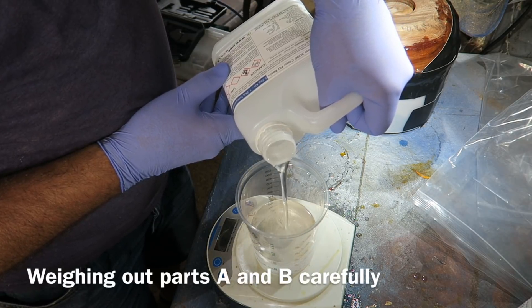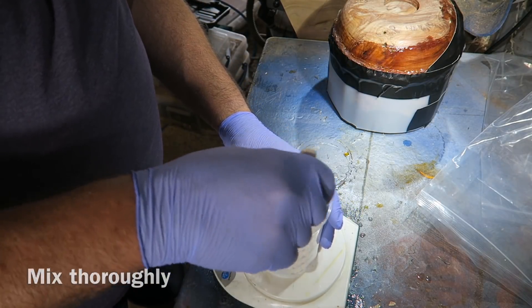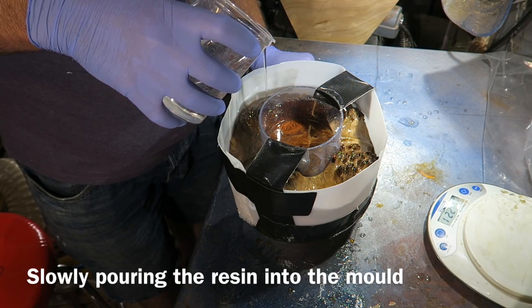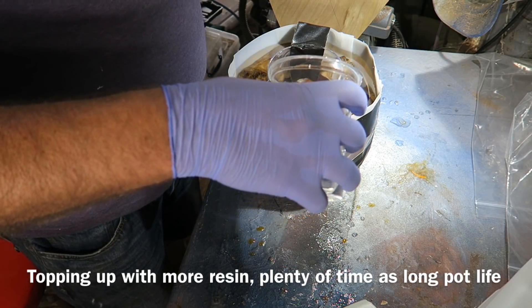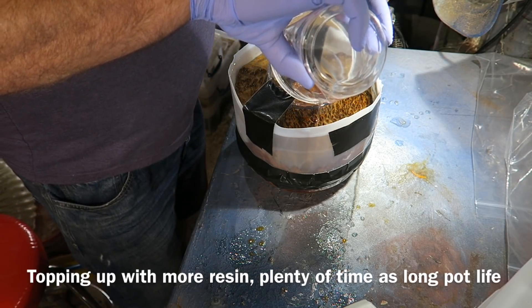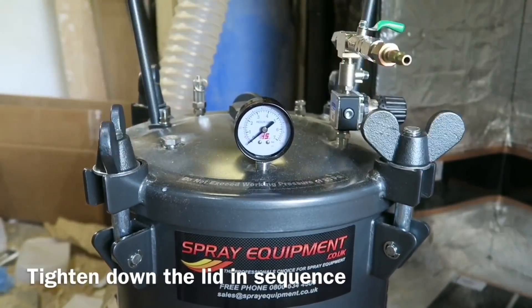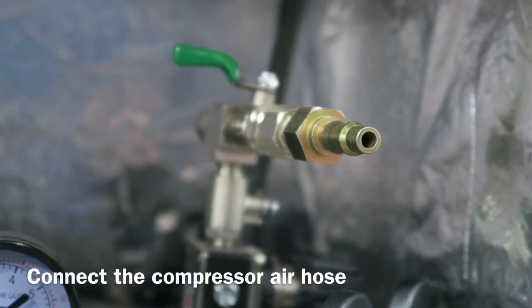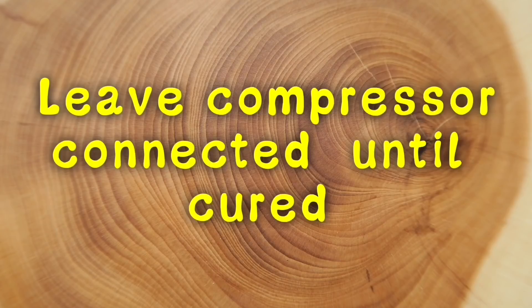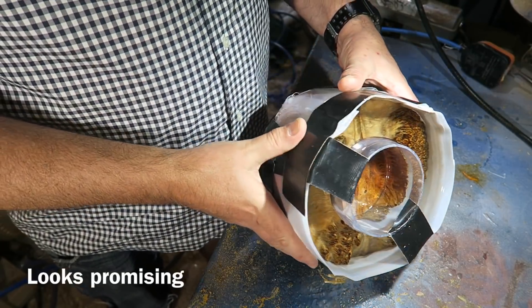This is OptiCast 3000 polyurethane resin from MBFG in Belfast — I'll put links in the description. This is a fantastic water clear resin. It's polyurethane, very slow set, and ideal for these big pools — it doesn't overheat. It took a couple of mixes just to fill it up, but you've got plenty of working time with this resin. Then it was into the pressure pot at 60 psi, with the pressure left on for the full 48 hour cure. It's quite a slow curing one, and I then left it for probably about three more days after that just to fully cure.